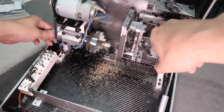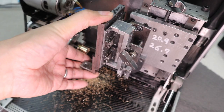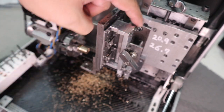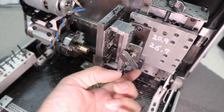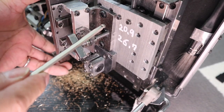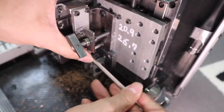Something is wrong — this sound indicates something is wrong. The bolts holding the X-axis were loose, which would make it impossible to process the machine properly. A machine with a lot of vibration is prone to loose bolts, so countermeasures may be necessary. Anyway, I tightened the bolt and tried again.